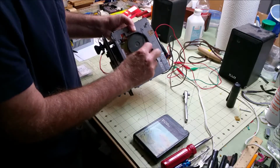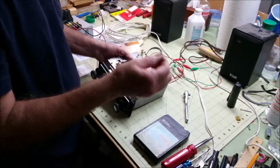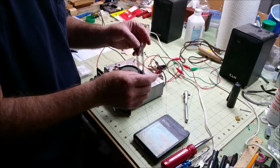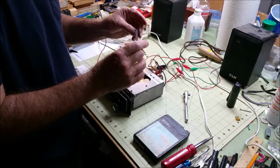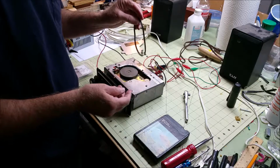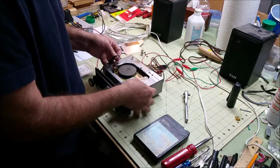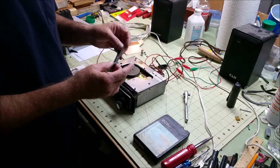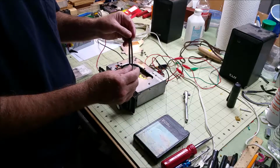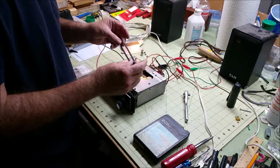This belt could be an original belt, I'm pretty sure it is, but it's in one piece and it's almost guaranteed to have been stretched, so it's kind of hard to determine what the original size was. And in the charts for buying new belts for these things, these are so obsolete that I don't think anyone's going to have a British Leyland player listed. At least I couldn't find one, so you're reduced to going by belt circumference. But it's not broken, so that makes it easy.